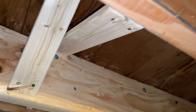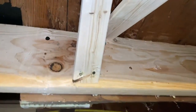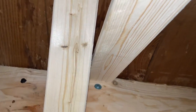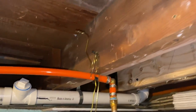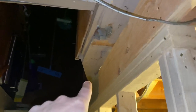I've put some new cross bracing in here — these help to distribute the load as you're walking up there. As a tip, don't put them tight — leave a gap like that, because if they're tight together they might squeak. I reattached this pipe over here with that hanger — should probably get a new hanger, that's not great. And I temporarily reattached this wiring — it's going to come out when I do the kitchen, but it's out of the way for now. I'm not going to take this out yet — I'm going to build all that stuff upstairs and kind of rip this out at the same time. But I will be able to open this right up to here, which I'm pretty pumped about.